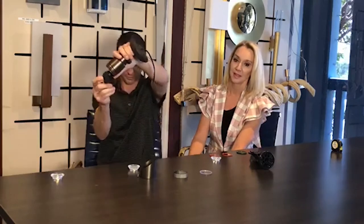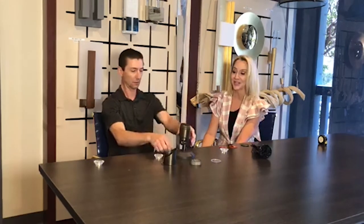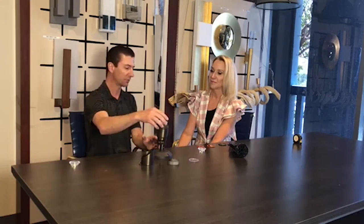This here is a dial selector — this is where you adjust your power. The power adjustment is from two and a half watts all the way to 10 watts, so roughly speaking 180-ish lumens all the way to 750. You would need the brighter lumen output if the item is further away. If I just wanted to light up my bushes, maybe they're as tall as this table, three or four feet wide — I need to back this up a little, put my 60-degree beam spread in there. I might only need two and a half to three watts. I'm not trying to blow it out, I'm just trying to highlight it.